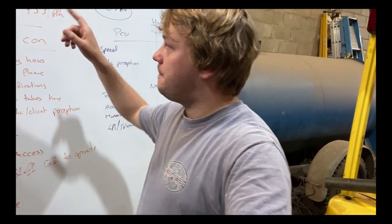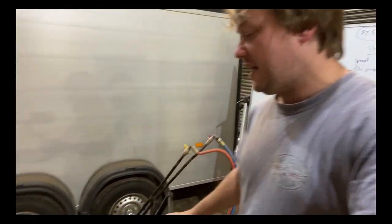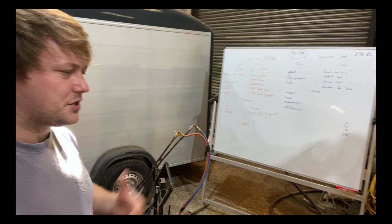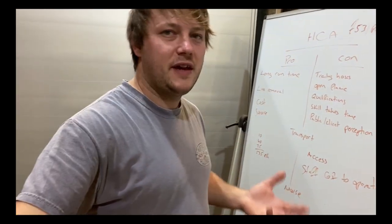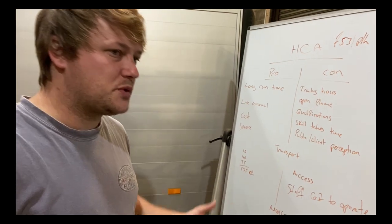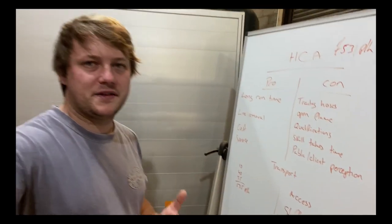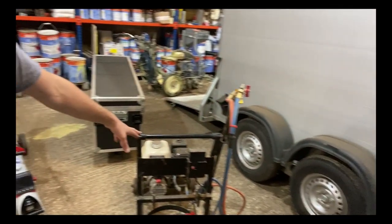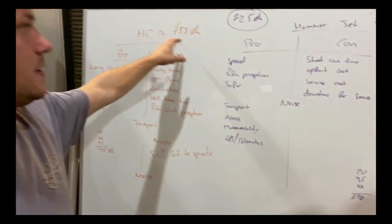To clarify those are my pros and cons for the HCA lance. For running cost per hour I've based mine on around £53 per hour to operate an HCA lance — that's because I put two operatives on it at £20 per hour each, taking into account national insurance, pension, holiday, sickness, and everything that goes into it. I've then added propane cost at around £36 to £40 for a 19 kilo propane bottle. To buy this machine we paid £3,500 — budgeting 1,000 usable hours gives an hourly machine cost of about £3.50, which brings you to £53 per hour.